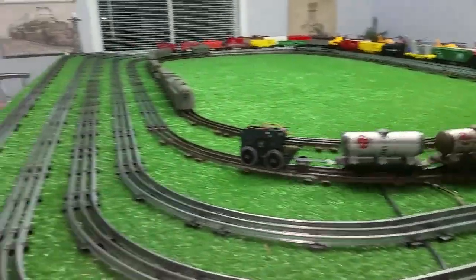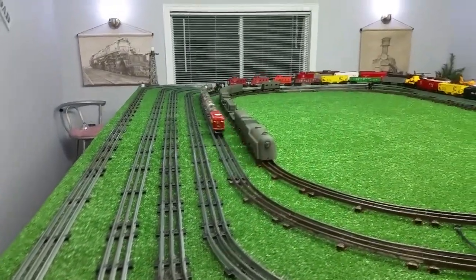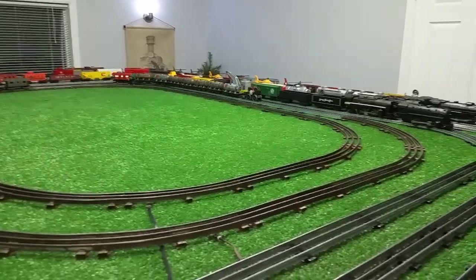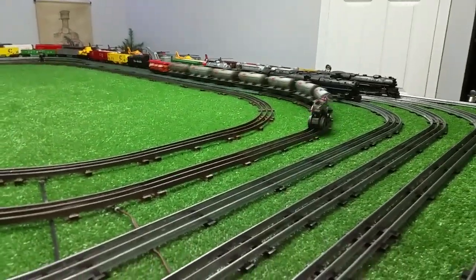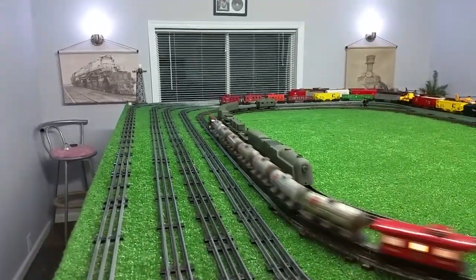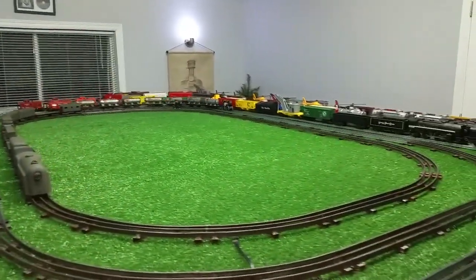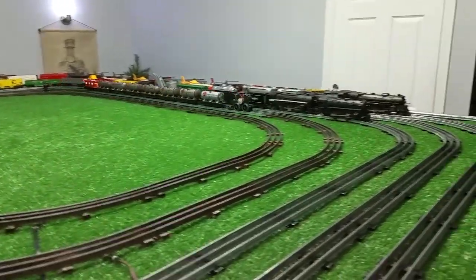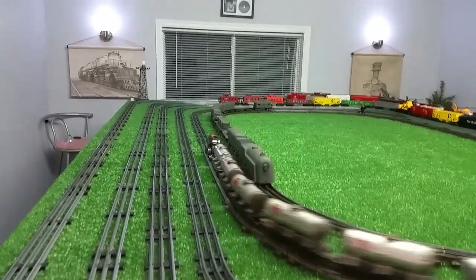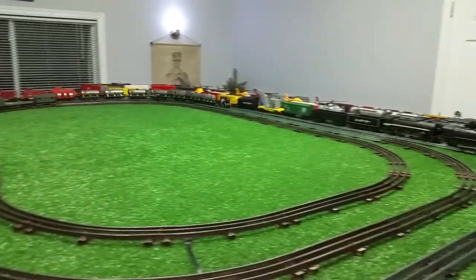So like I said, I'll put a couple of diodes on this and just reassemble it back into a locomotive and run it on AC. It's up and running. There's nothing wrong with that motor at all. The electronics were gone. So it works. It's a really, really simple expedient. A couple of diodes only cost, I don't know, $1, if that. And I can just reassemble this and run it on AC just using 2 diodes. So that works really well.